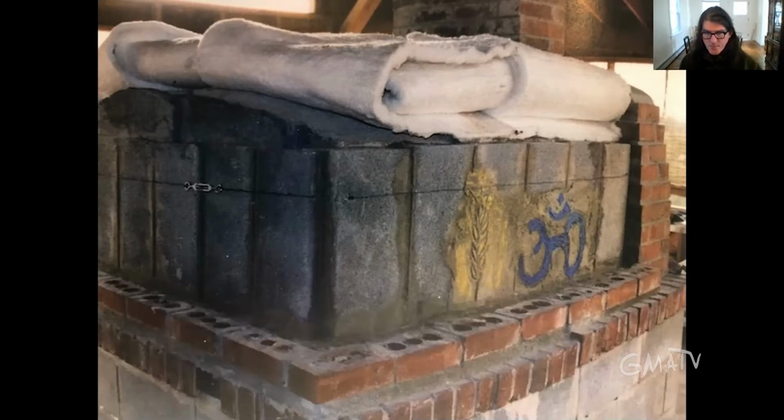down in North Carolina. And once you have all that thermal mass heated up, or even as it's heating up, we want to be able to keep that heat in there. And there are a lot of different materials to do that. The oven should be insulated underneath, and that could be as simple as vermicrete, which is a mixture of cement and vermiculite, not nearly as efficient as calcium silicate board, but a lot less expensive too. And then on the top are kiln blankets, and those are highly efficient and really keep the heat in there.